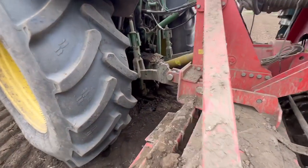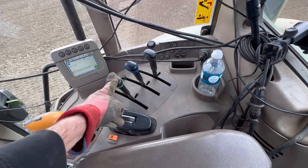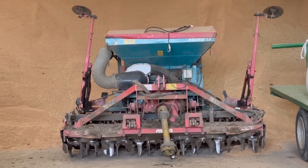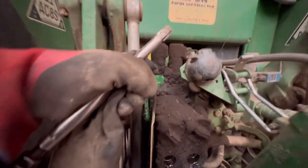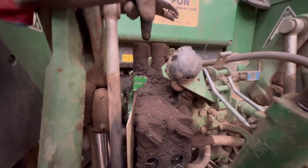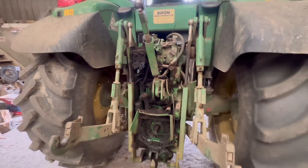Apart from I've got a leak at the back of my tractor. I think it's this spool valve. I'm guessing I've got a leak on my marker somewhere, so I'll just not use that one now. Fantastic. Oil's expensive as well. Diesel's expensive - I've spent a fortune on diesel today. One hundred and thirteen and a half pence I think it was for red diesel - yes, a lot of money. Back to the farm now, we've dropped the drill off. Inspecting the back of the tractor, it's very oily and looks like it might be leaking from the top where you can alter the spool valve into constant pumping. Looks like it's coming from there, but when I'm using the sprayer I always use a second valve, so it's just going to have to do for now and we'll look at that soon. I need to get the spraying done.